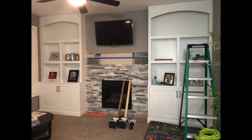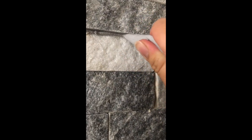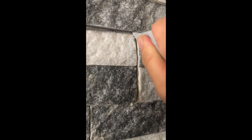So to fill in the gaps in the stone, instead of using a trowel and kind of shoving it in there, the easiest way that I could actually find was to take a pastry piping bag, fill it with grout, cut a small tip, and then I was able to press and maneuver it into the small gaps, then just smooth it out with a wet towel or my fingers. It's probably a little unconventional, but it definitely worked.